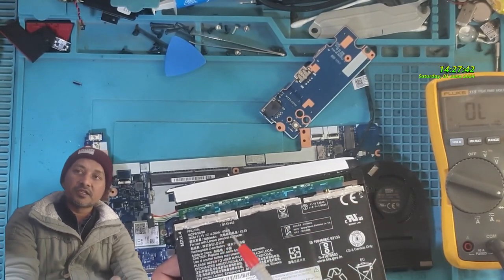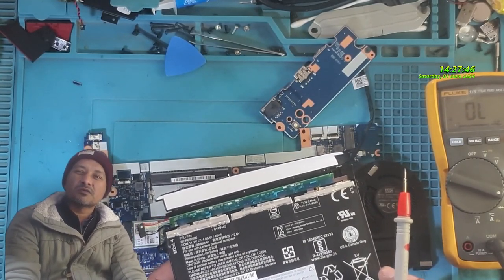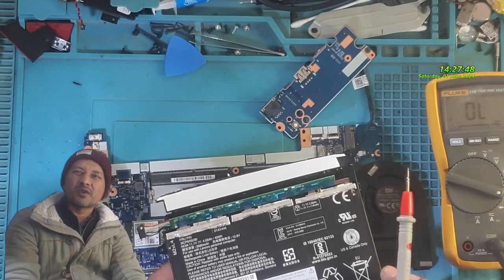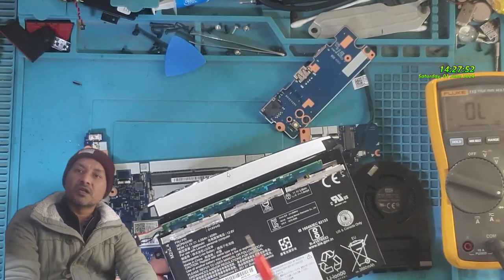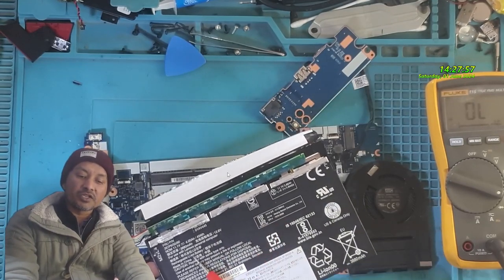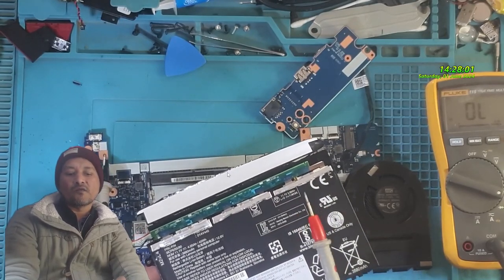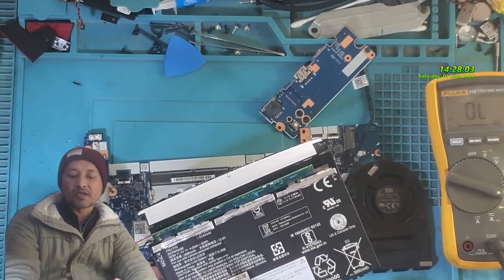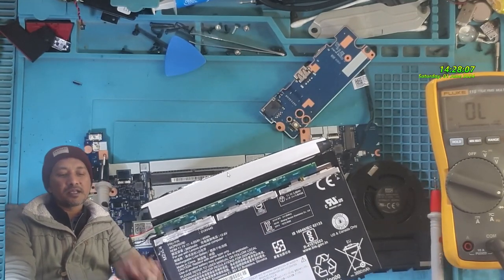I check each individual cell, they were about 1.3 volt, so it should have 3.7 volt. When it has 3.7 volt each cell combined, it make about 11.1 volt, which is what this battery is supposed to give output. And then what I did,